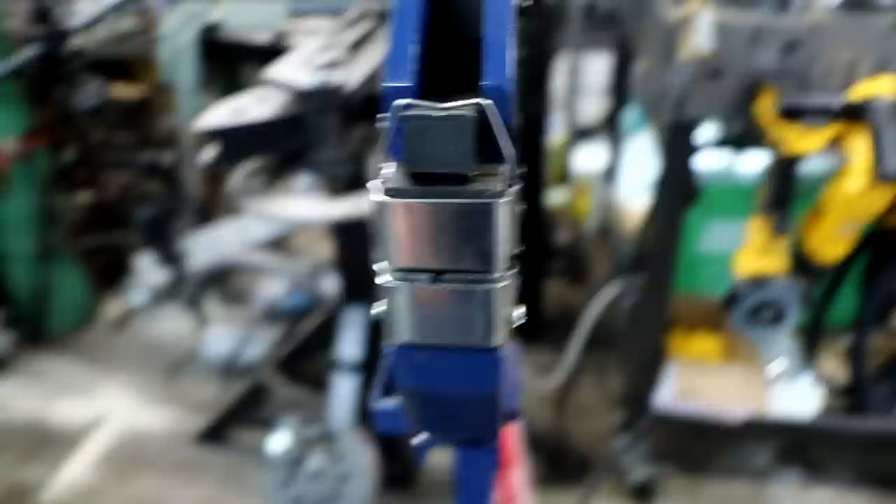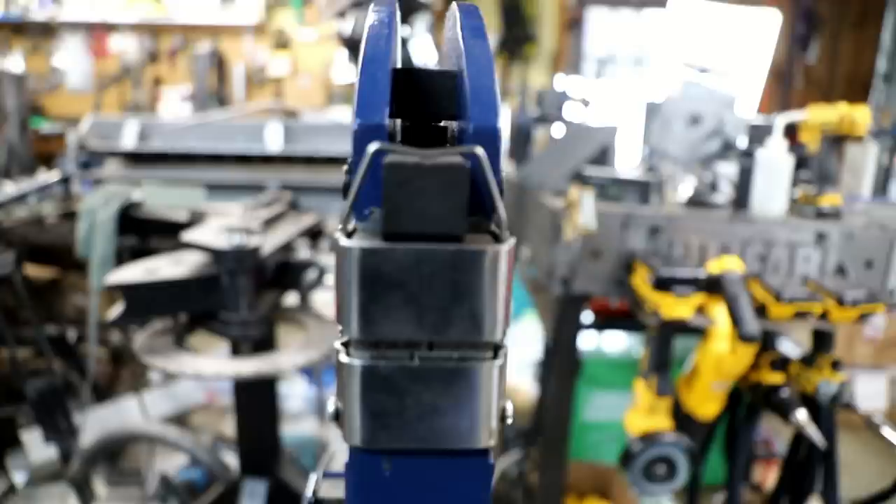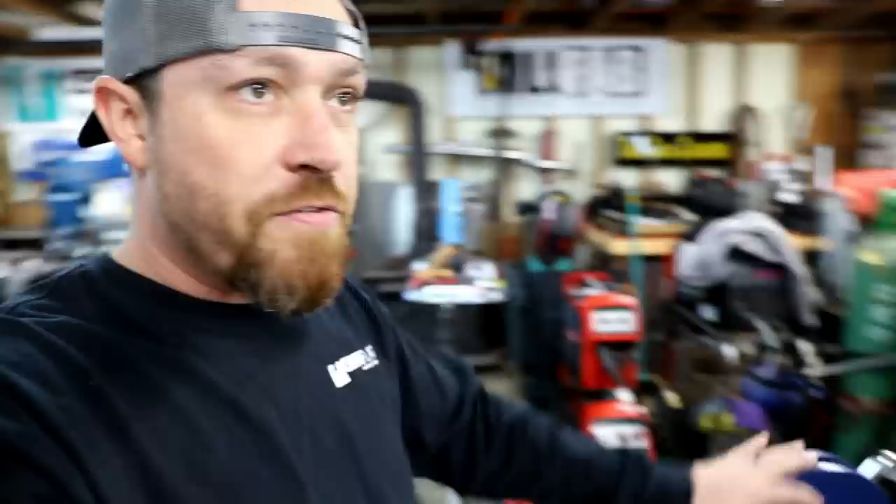There are other ways of stretching and shrinking. I've shown this thing before — it's a shrinker-stretcher, and it works basically with jaws. As they clamp, they basically spread apart or shrink together. In its current configuration it's shrinking — as those jaws come down and together, they pull the metal together and shrink it. But you can also get jaws that will stretch in the same fashion — I actually have a set of jaws for this. For me, I didn't want to change jaws every time, so it's better to have stretching on one machine and shrinking on another.